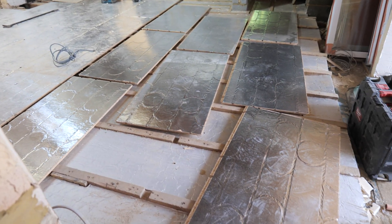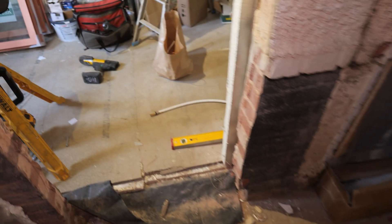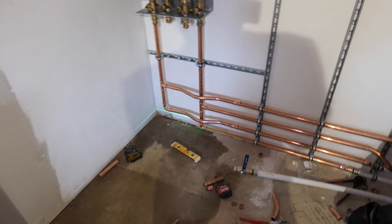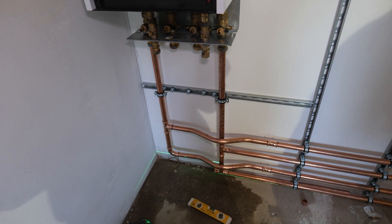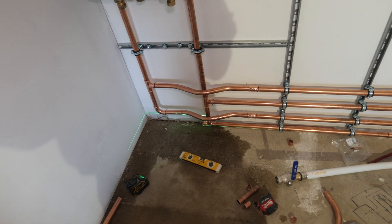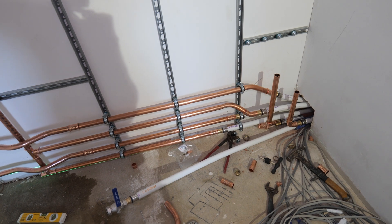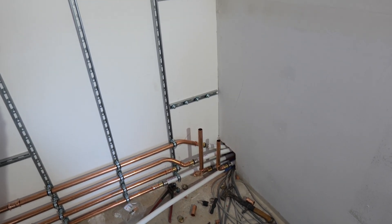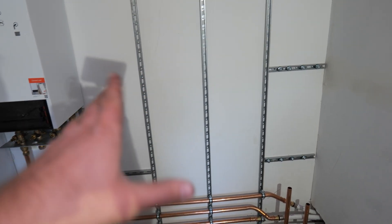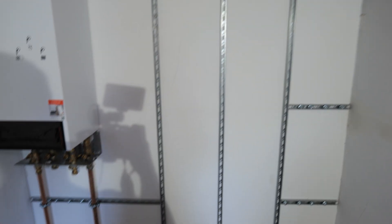We're making a bit of progress. Mark is well underway installing the OSB groove chipboard panels for the underfloor heating. This is our flow and return coming out of the unit — not the flow and return to the heat pump, but to our heat emitters. We've got a small radiator zone with a few rads, and the majority is all underfloor heating, all teed in together. Bailey has got the task of sorting out the MLCP. We've got a 300-litre cylinder going somewhere here and we're going to run the pipes up and over to get it all neatly organised.